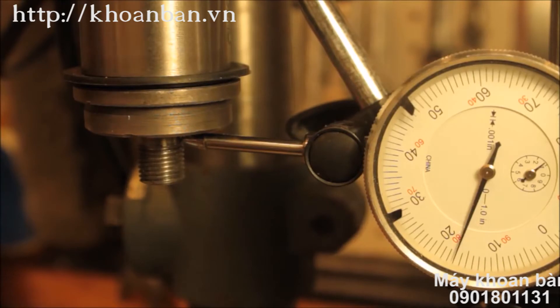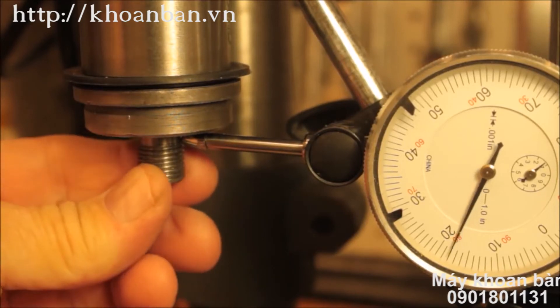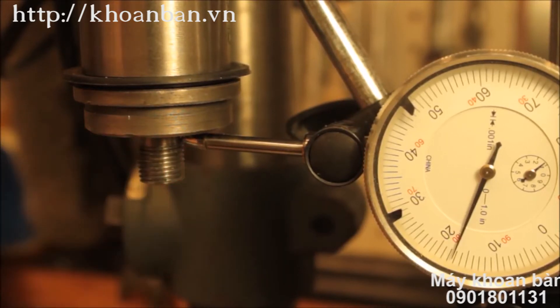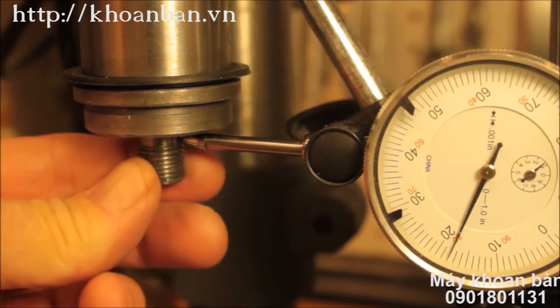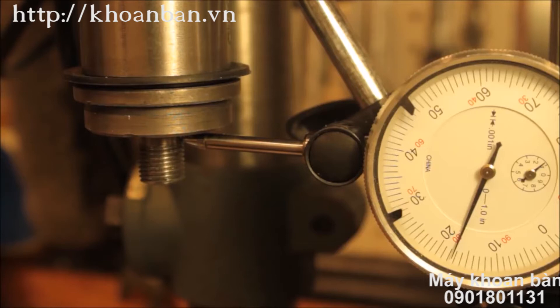Let's have a look at the runout on this thing — that's just the spindle. This came off my lathe and I know it's truer than that from the lathe, so this is in the bearings. Also look at this: if I just push this back and forth I get a certain amount of play. There's no way to preload those bearings; the spindle just doesn't have such a feature. So I'm going to have to live with about three or four thousandths of plain play in it.